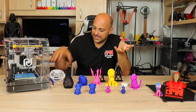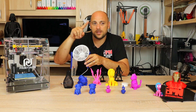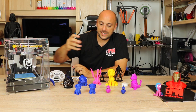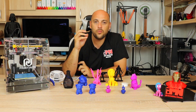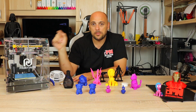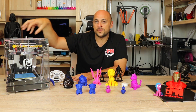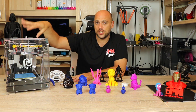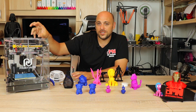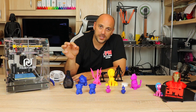So what I did was build this frame with a USB fan — I did a video on it and you can see the difference it made; it was a well-needed add-on. There are possibly other ways to install a part cooling fan, but the problem is that the carriage is quite large and there is not a lot of room. The idea would possibly be to do a Bowden extruder, and then you'd have enough space to install a specific part cooling fan.